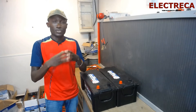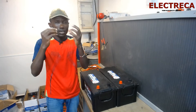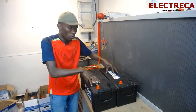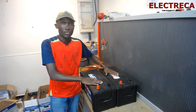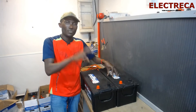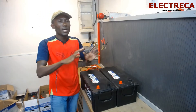Mostly you'll find 12V. So if you have a system of 24 volts but you have two 12-volt batteries, you can use a series connection. That series connection will give you 24 volts — you sum up the voltage of the two batteries to get 24 volts.